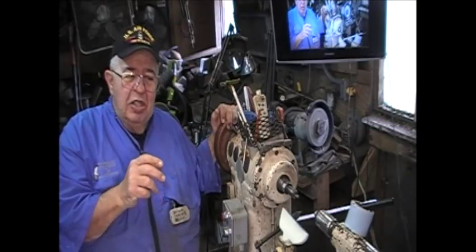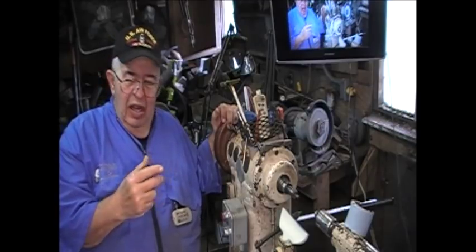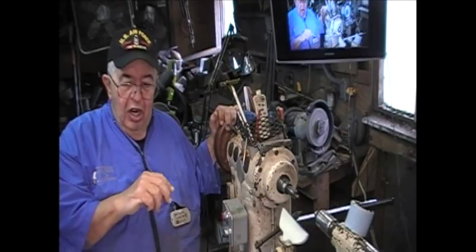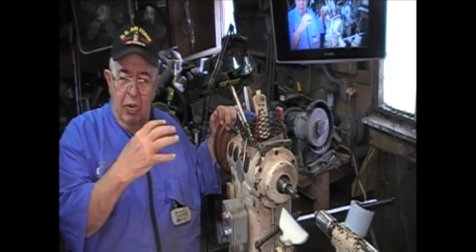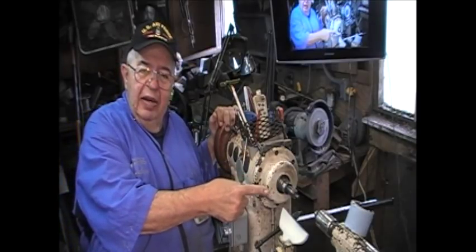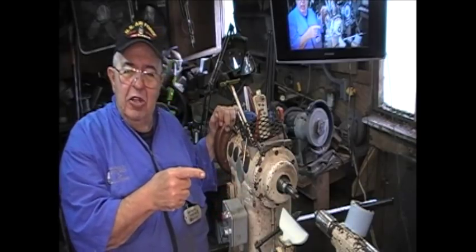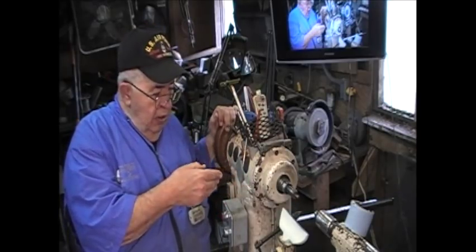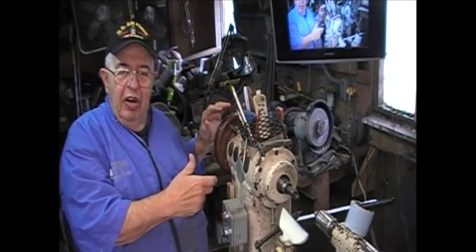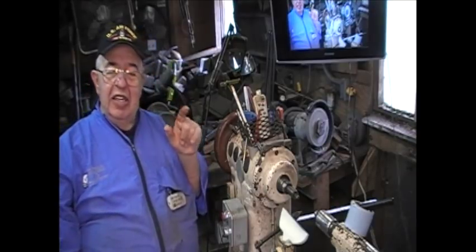Also small jars, a vase. I did a reverse. I love reverse chucking and flip-flopping things. When you do a lid on a jar, to turn it around and grab it again, to put decorations on or whatever, you can thread a piece of wood on there. A piece of junk wood. A piece of Ronnie's 2x2. And you can shape it, turn it up to speed, shape it, and you can make it fit right into the lid or right into the cover. So you're holding it wood on wood. Boy, that thing is a savior.